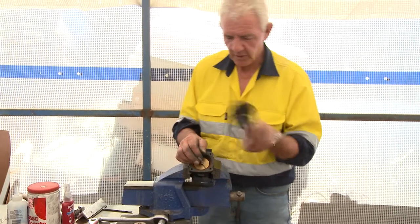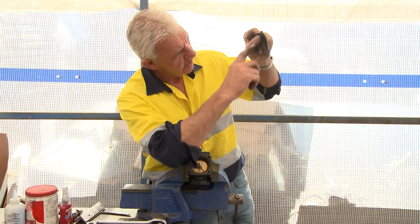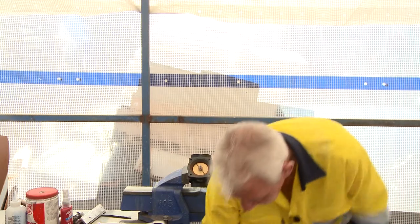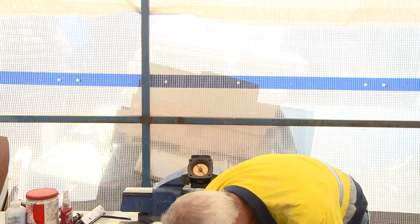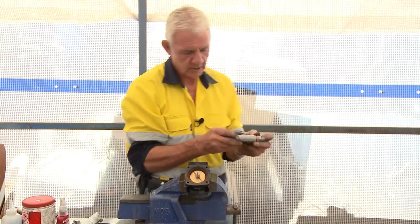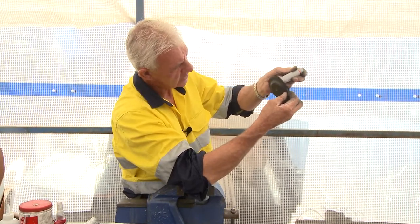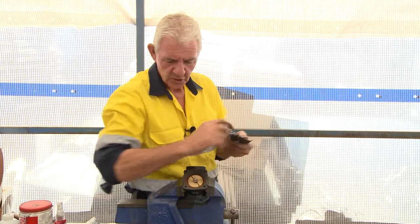There's the diaphragm. What you need to do is hold it up to the light. If you hold it up to sunshine - and if it's night shift, hold a torch behind it - even a simple small torch will do the job. A small torch is enough to see if there are any perforations or holes in that diaphragm. In this instance it's not too bad.